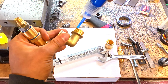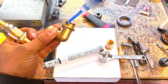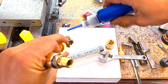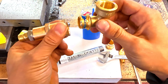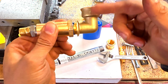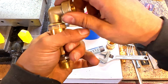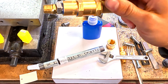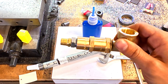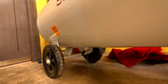This will then go on to the elbow like this, so let's go ahead and put this on to the elbow. As far as I understand, brass pipe fittings normally have a mating and interlocking surface where you don't have to put tape on, but I've experienced that a lot of stuff from China is no longer to standard. So let's go over to the compressor, release the air, and then continue on.